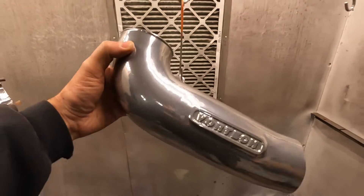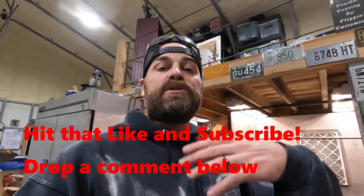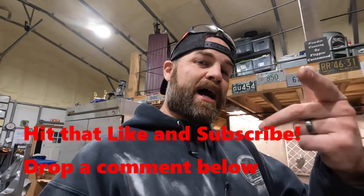To recap the process: blast your part, apply epoxy primer and let it flow out, take it out and let it cool, then apply your chrome and fully cure it to get maximum shine, let that cool, then finish with your acrylic clear. It's quite a few steps to get to that finished chrome product, but at the end of the day it comes out real nice. It almost looks like highly polished aluminum to me — just my opinion. Drop a comment and let us know what you think. Thanks for watching — Scott, Flipping Customized.